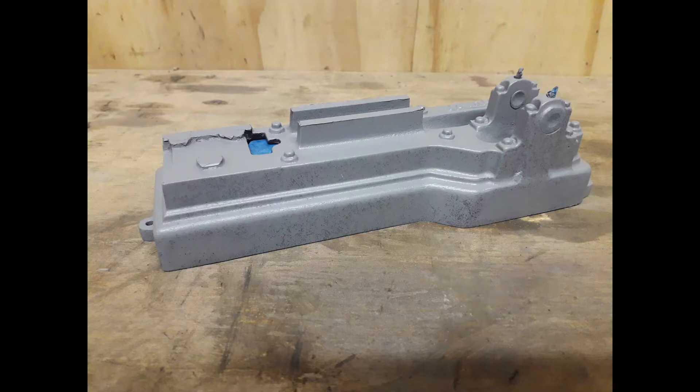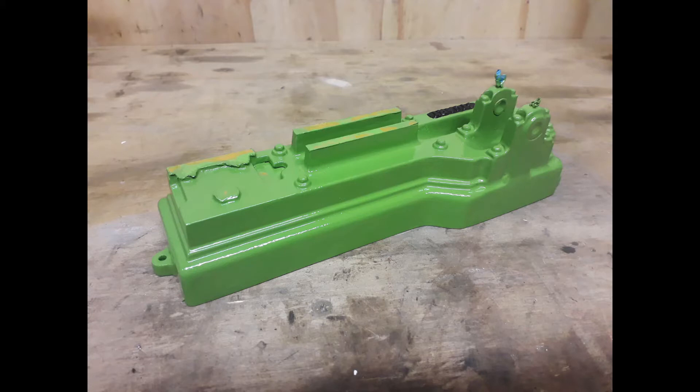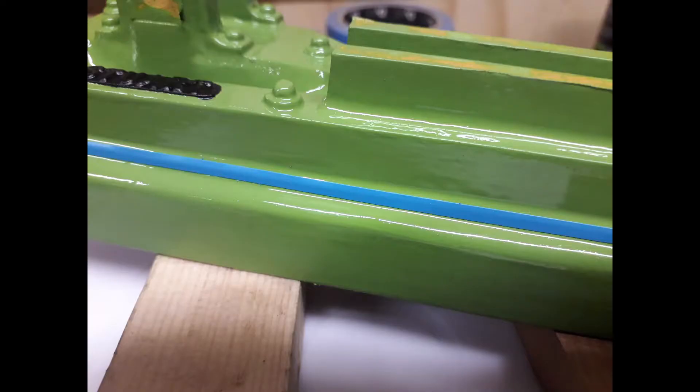Then we're going to the glossing. On this we actually glossed it with the brush. I was thinking of using a little gun and spraying it, but I thought most people will be using a rattle can of etch primer and a brush, so that's what I've done. Get yourself a good quality heat-resistant paint, because obviously it's going to get warm when you run it on steam. You can mask up if you're doing the black at the bottom — you can see the blue tape there to paint the black bit at the bottom.